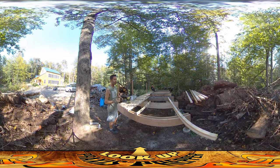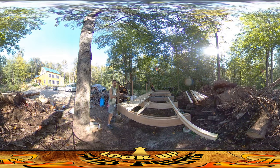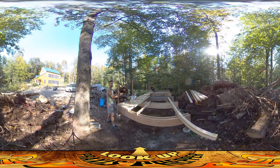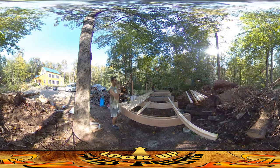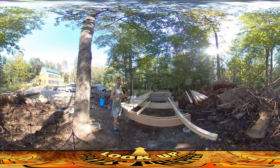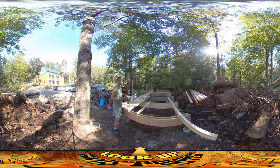Before I did this, I made sure that I got all of these floor joists nice and plumb — straight up and down level. I put these temporary posts in, clamped them together, and used these tie-down straps to get them all nice and vertical, because once I put the posts in I don't want to be fighting with the deck to try to get things vertical later on.